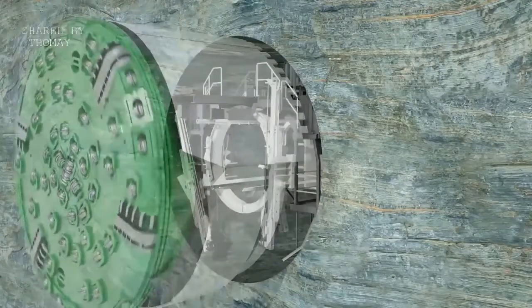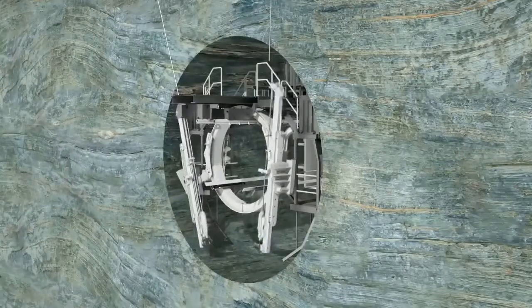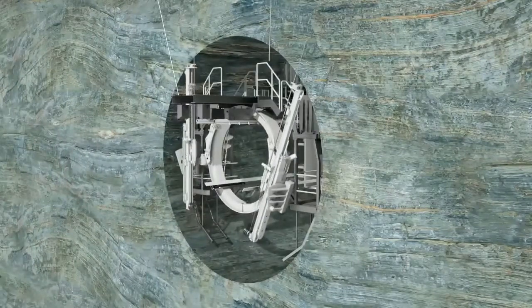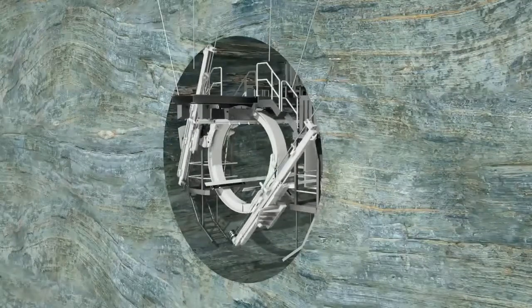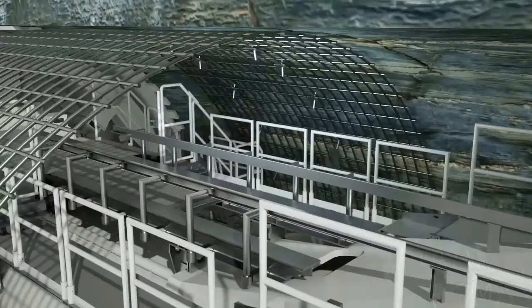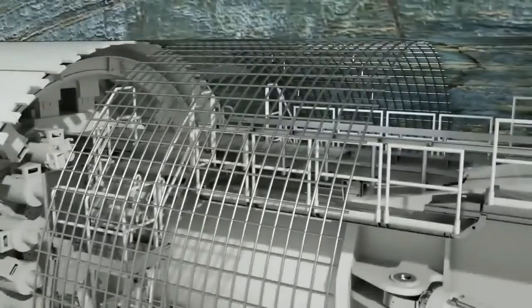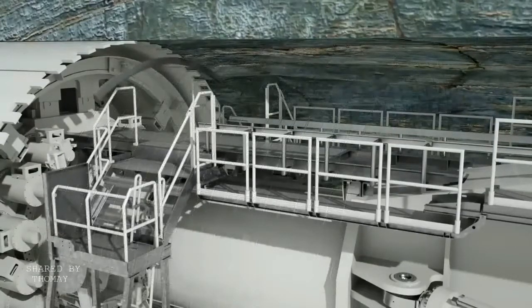So-called L1 area, effective measures for early temporary rock support are possible. Roof bolt drilling rigs create radial boreholes directly behind the roof shield to install the rock bolts. Steel mesh mats can also be put into place. They're positioned directly behind the roof shield and serve as protection against rockfall. The use of steel ring beams also helps to secure the tunnel. They are pre-installed directly under the roof shield, out of the rock.